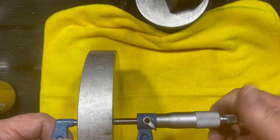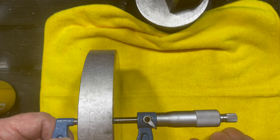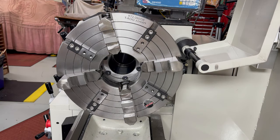That's okay for smaller lathes, but for this lathe, a chuck can weigh upwards of 50 kilos, or almost 80 kilos for a 400 millimeter chuck, and that makes life difficult and poses some risks that are to be avoided if possible. These height blocks are easily made and are a useful addition for four-jaw chucks that have T-slots. They make further machining operations a lot easier and a lot more accurate.